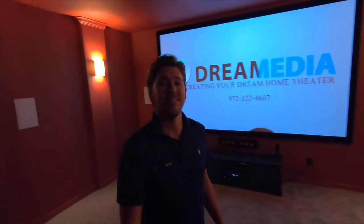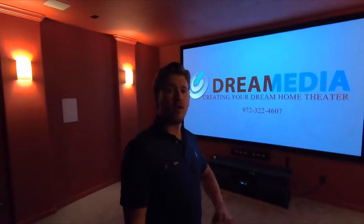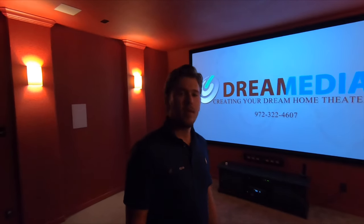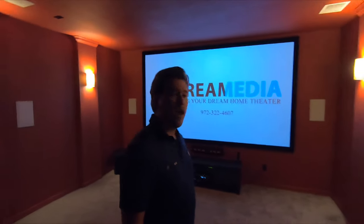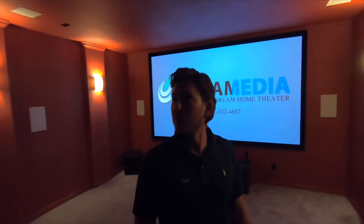That turned out awesome. This configuration is a Klipsch Professional Series 7.1.4 Dolby Atmos system. The installation turned out great. The only issue we ran into was that gas line installed right over the pre-wired location, but we got with the builder and they're going to come get that patched up. Everything else is just awesome — the customer is extremely satisfied. Audio and video performance are on point. We have the 145-inch high-contrast gray screen from Dragonfly, the Epson 4050, which is the best value this year. It performs awesome at a very reasonable price point. All the wiring is hidden in the wall. HDMIs are all up to spec — 18Gbps, 4x4x4. Everything is surge protected.